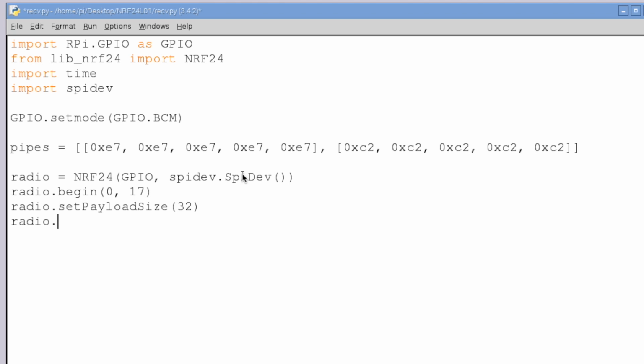We can set our channel. Obviously, the channels have to match between the two Pis. So I'm going to choose channel 60 here. So we're going to be connected on channel 60. And then we can set our data rate. The higher the data rate, obviously the faster your transmission speed, but the riskier it is for long distance communication.